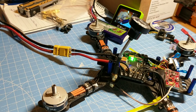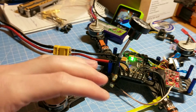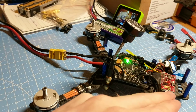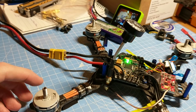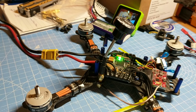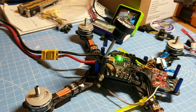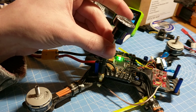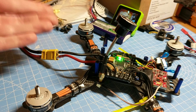So if anybody has any idea why that is, I would love to know, because it is the only thing preventing this build from flying right now, and I've already torn the whole thing apart three times trying to fix this problem — remounting the UFL adapter, soldering it in place, gluing it in place, moving it from underneath the flight controller over here. I thought it was interference from the FETs on the base of the Asgard 32, but no, it's just something to do with when it grounds on the carbon. So why making continuity between ground and the SMA and the carbon is an issue, I can't think of anything else, and I can't continuity test anything else that is actually conducting through the carbon at all.